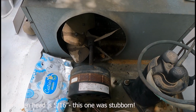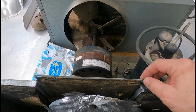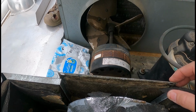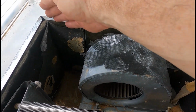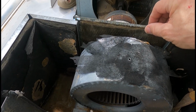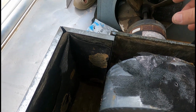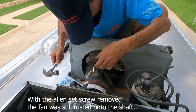And so his plan there is to remove the fan blade from the fan drive shaft. And then back here on the back of the casing, you notice there's a door here that's like a port door. There's some screws in the bottom of that door, and I believe if we disassemble that the squirrel cage fan will pass through this retaining wall here and go right through where this port door is, and we'll have enough clearance over here to bring the motor forward, free the fan squirrel cage, and then remove the motor.